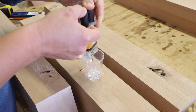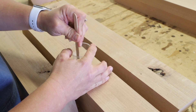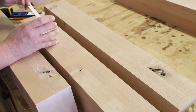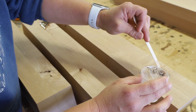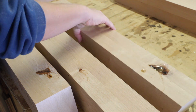The lumber I purchased was clear alder, but that didn't mean there weren't a few small knots that needed to be filled. I mixed up some DAP TankBond Clear Epoxy to help with this. I love using this for small knots because it dries so quickly and saves me a ton of time. I was able to get back to work on the legs within an hour once the epoxy had fully cured and could be sanded.